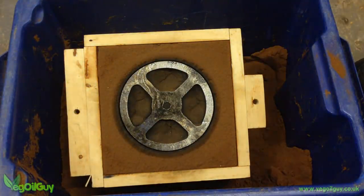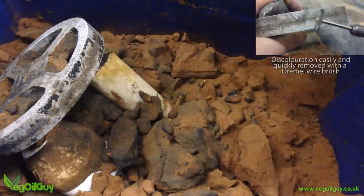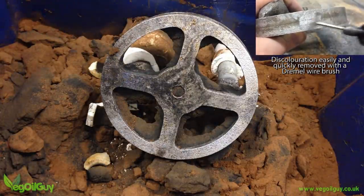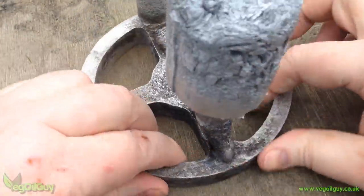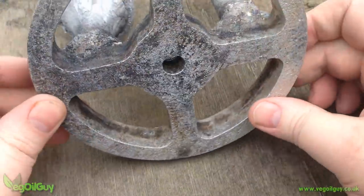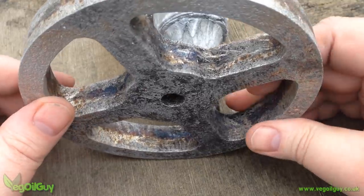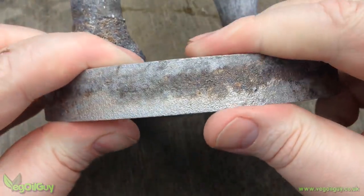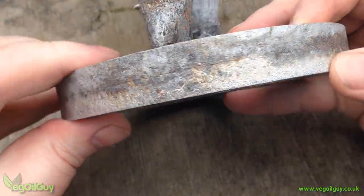That's why green sand blackens over time. Looking at the wheel inside the sand, I was pleased. Sure it had surface discolouration due to the decomposition processes, but this could easily be cleaned up. Here it is half an hour later with the sand removed. It's nicely formed, good crisp edges and almost ready to go. Everything is beautifully straight and flat. It may look rough and sure the texture of the foam is evident, but it's just discolouration. Once the surface is lightly cleaned, these will disappear and the proof of the process will be revealed.